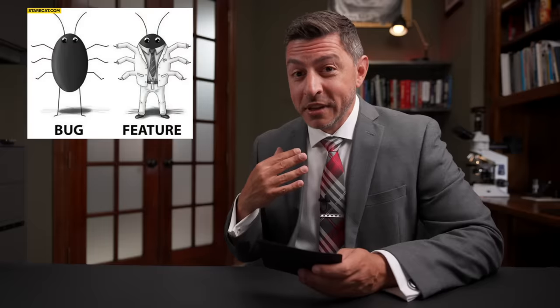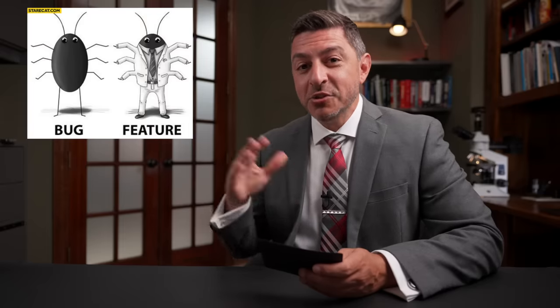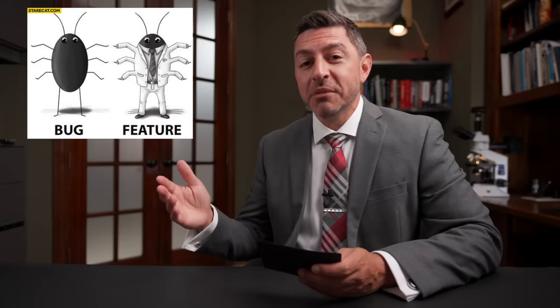The claimed feature is: I want to be able to reprogram this chip faster, so don't erase all the memory — just erase what I define. In this case it was set to 8k of the memory, not all of it. I would call this a bug, because any feature that lets you have your code dumped out in the simplest possible manner is crazy — there's no world I come from where that's a feature. That's just a plain bug. You should know the bootloader version this works on is 2.8, and this will likely be fixed in a future release so that if you set all the code protect bits, you can't get the code out.